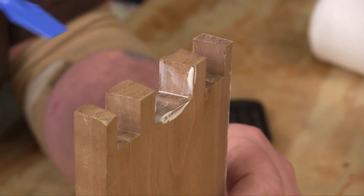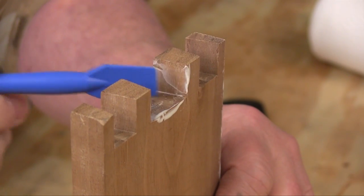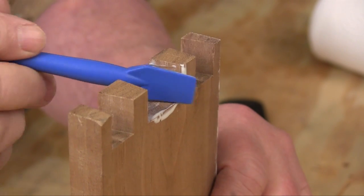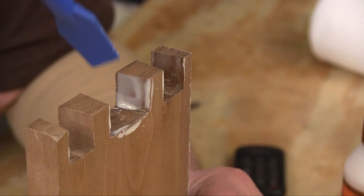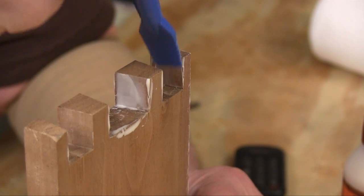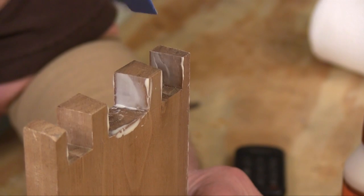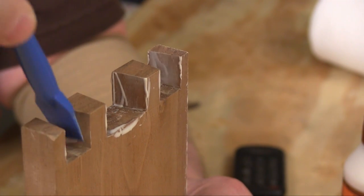Then the first time around it took me a little while to figure out the paddle end of this brush. Going across the joint like this, it's easy to leave a bunch of glue on the outside of the joint. But before long I had one of those brain deals and realized that if you go up and down on the joint like this, you don't get hardly any glue on the outside and you get a nice coat on the pieces you want to get coated. So this end works good too.